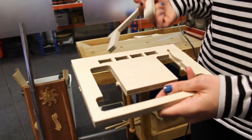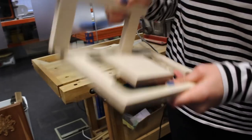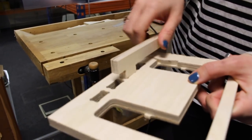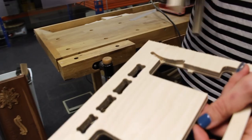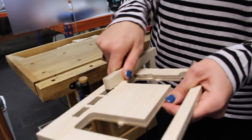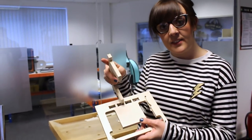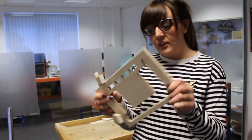This one we've done at 0.015, and if I just pop this side in, you can see it's quite loose, not too bad. However, there's quite a little bit of give there, so that may be too much. And then this one was done at 0.02, and again, you can see there is a lot of give in there. That wouldn't be very practical. So I'm going to go with that negative 0.01, nice snug fit,